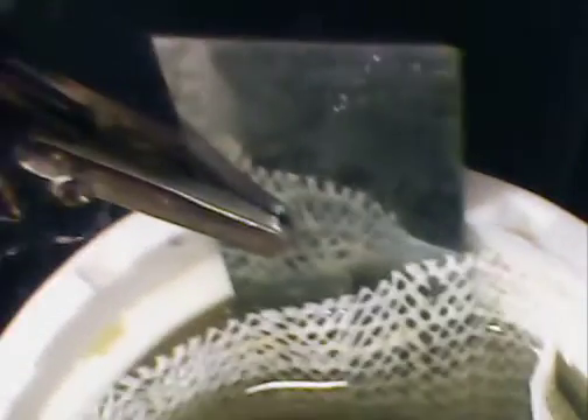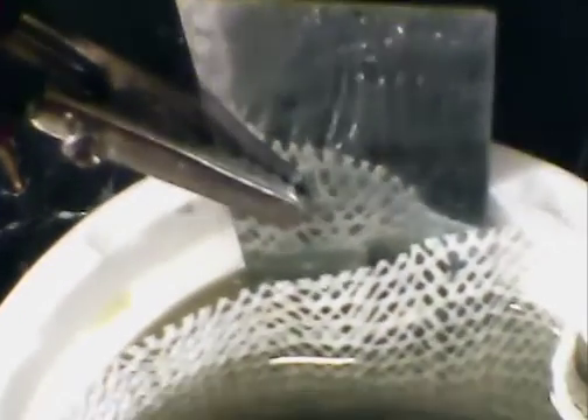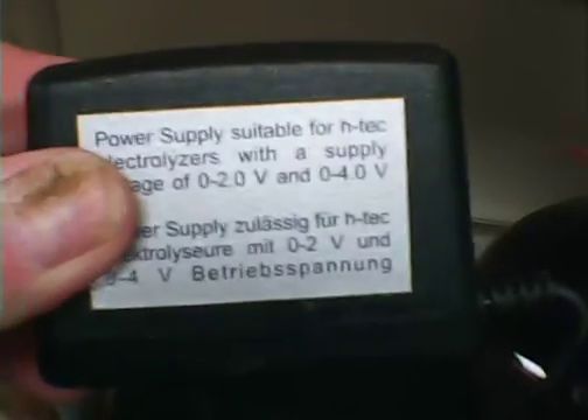I have a big sheet of it, so I figured I'd work with that. I'm also working with zinc and stainless steel — it's the lower-grade stainless steel for scouring, a scouring pad. It's magnetic, very low nickel content, standard chromium. I charged it up using a 5-volt AC/DC adapter delivering 5 volts at 500 milliamps. I charged the cell up.